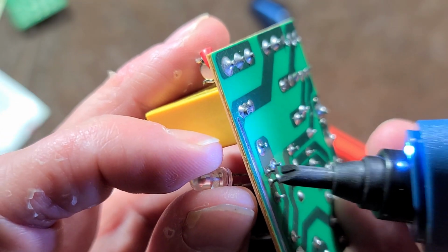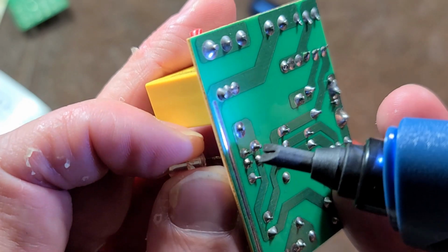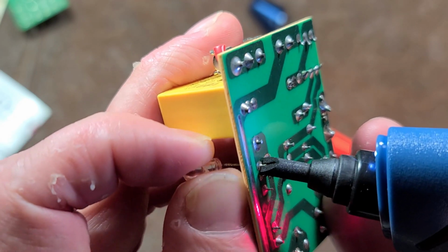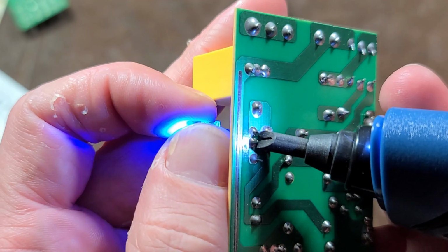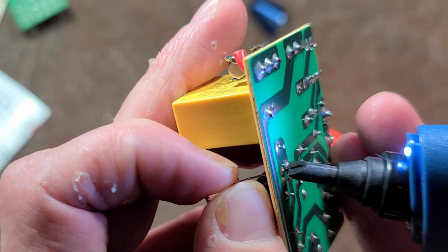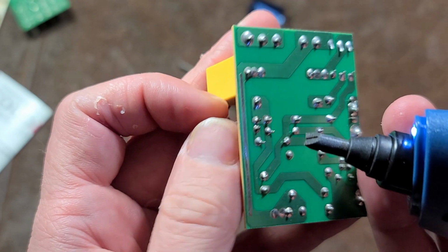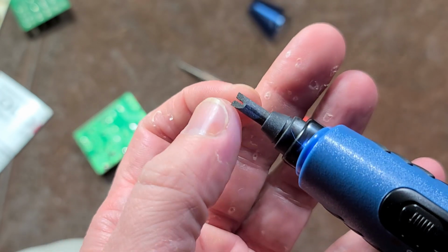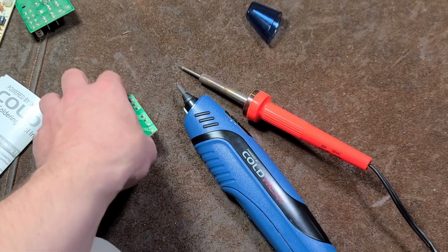So you can see that's one of the big issues: simply causing way too much power to go through so many components, like an LED that you may want to save. You could easily just burn it up. I was able to get one of the pegs to move. It seems as soon as it moves and the solder isn't distributed properly, it just can't deliver enough energy. The problem with this is the legs on this diode are too thin and are actually slipping between the two tongs there. So anyway, ColdHeats are generally not recommended.